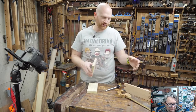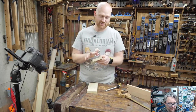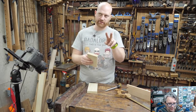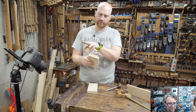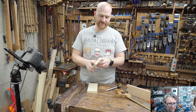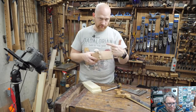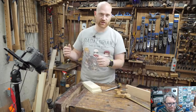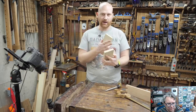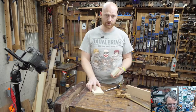And so this is one of the points, even with dovetails, where it comes out. But in this case, what I'm going to do is make them odd sizes. So it'll be 3/4, 3/4, 3/4, and then the 2 in the middle, I'm going to make whatever is left over. And the nice thing about that is if you're making these with power tools, usually they're going to be the same size all the way across, because it's really easy to have a jig that goes pop, pop, pop, pop. And if you make them odd, in other words, big one, little one, big one, little one, that's a little bit harder to do with most methods of doing with power tools.